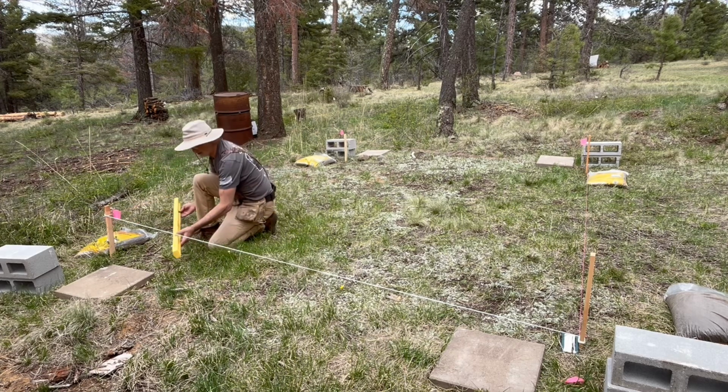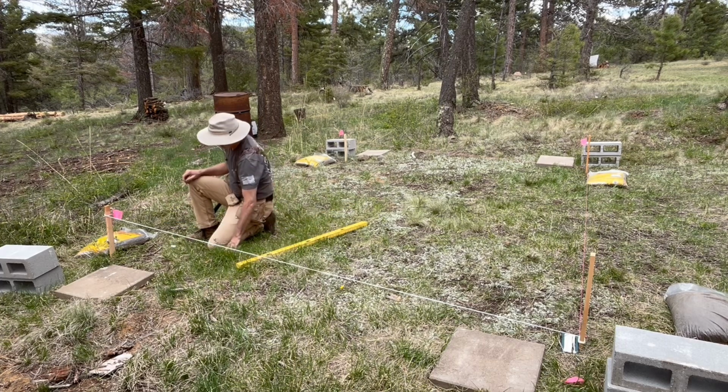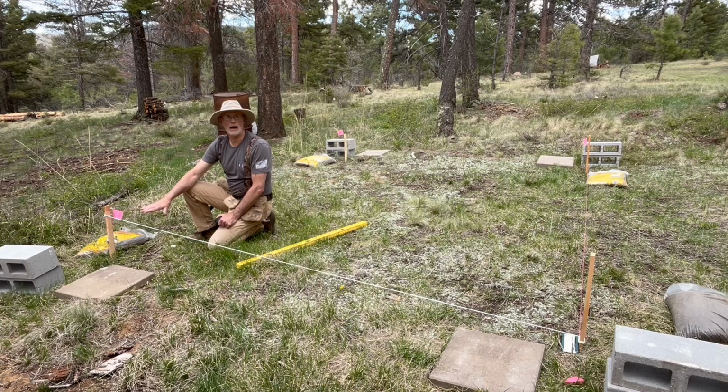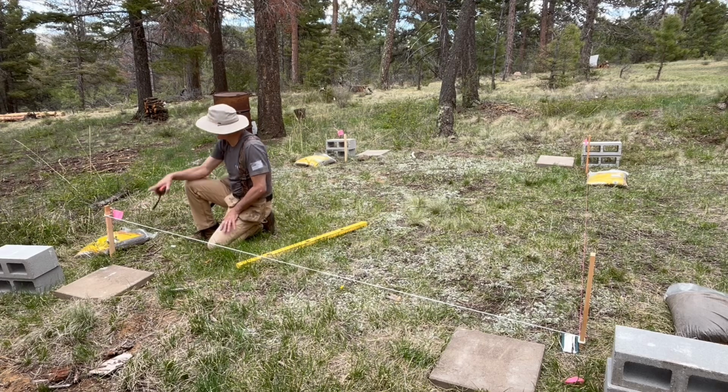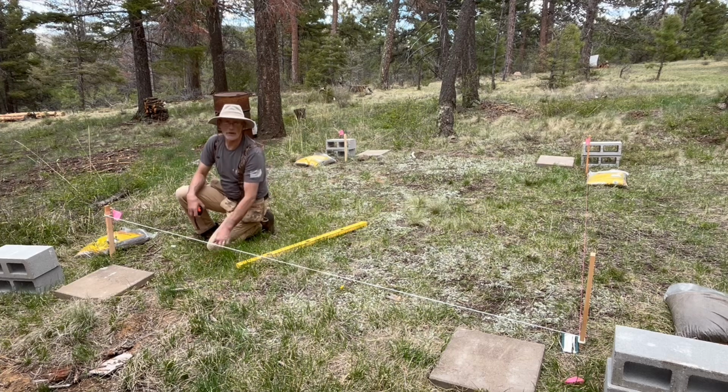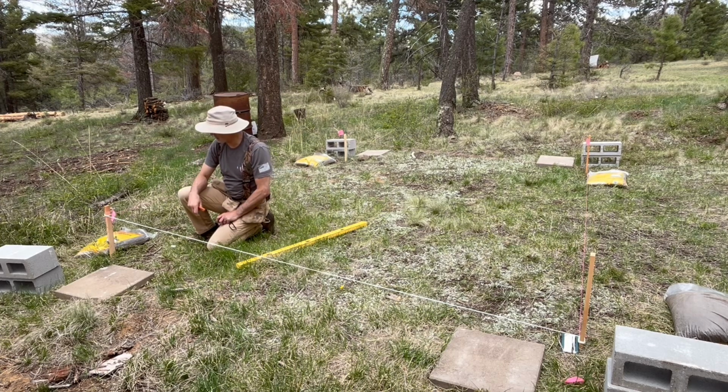Yep, we're level all the way around this thing now, even the corners. So in other words, this one I'm going to shave the ground nice and level, and it's going to literally be sitting on top of the ground. There, I'm going to have to dig it down deep enough that maybe I just use one block in the corner instead of stack two, and stack two on these corners and one on the other. So I'll figure it out, but at least we got it level. We got the corners marked. I'm writing my measurements into the corners, and then it's time to start digging.